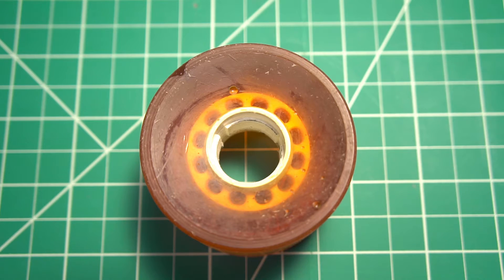But right from the jump, we're going to run into some problems. Cores are really intricate shapes — they have all kinds of thin sections and gaps, and that's going to make them very difficult to cast with any of the methods we've explored so far on the channel. They also need to be precise so that our wheels stay aligned to our axles and our boards roll straight and smoothly. So, a very demanding part to manufacture, and I have been driving myself mad trying to figure out how to do this.